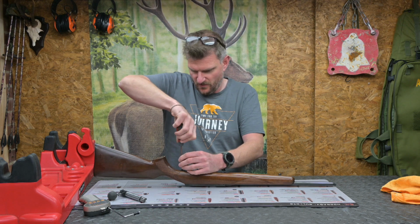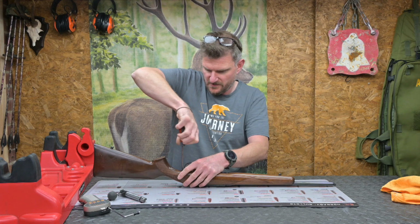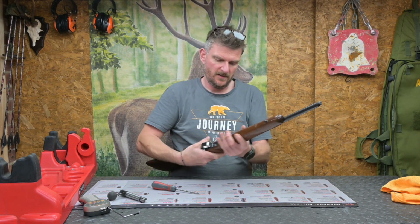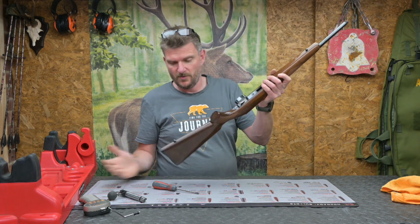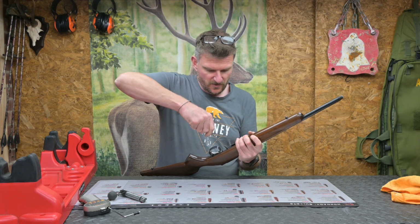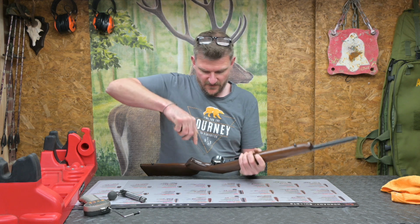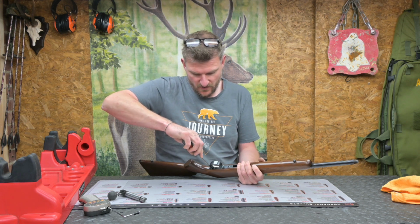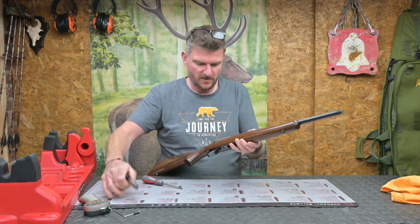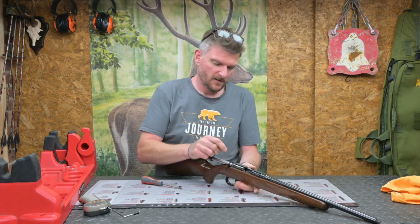Don't, whatever you do, start swinging on things too hard. Right, that's going to go back in there now, that's fitting fine. So I'm just going to bump the back of the stock, make sure everything's fitting back towards its recoil lugs. Of course it's a .22 rimfire this, so it's not massive recoil. Forgive me for not looking at the camera, I'm concentrating on what I'm doing. And then the bolt goes back in here.